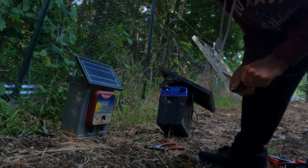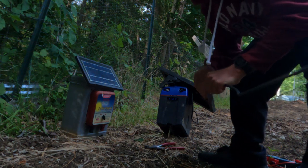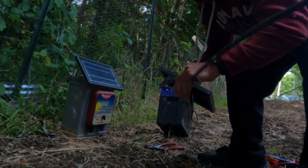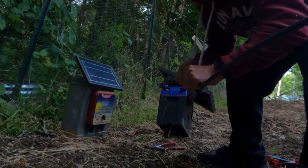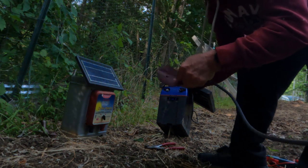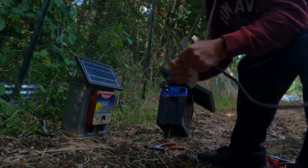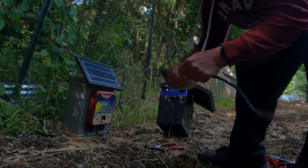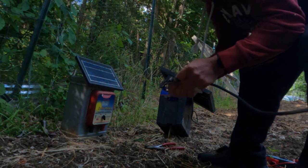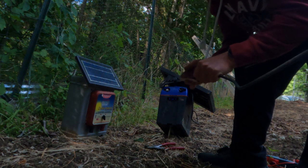We're going to find out here in a minute. I'm basically just using sandpaper to sand it down until it's nice and shiny. Generally I'll try to use what's called dielectric grease — the kind you'd normally put on automotive battery terminals. You can put that on these connections and it will keep them from corroding.